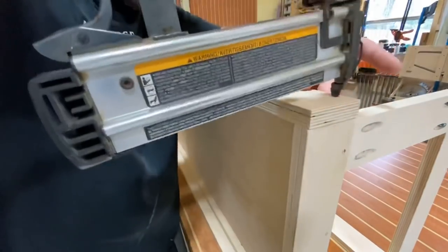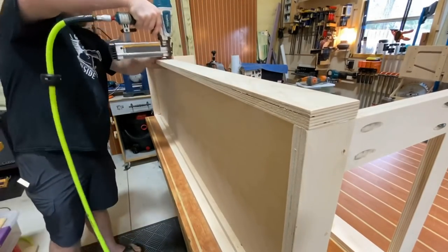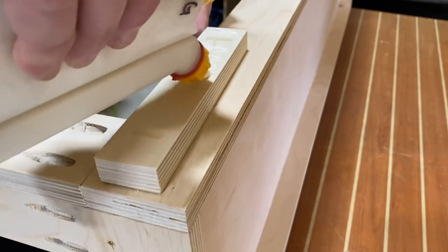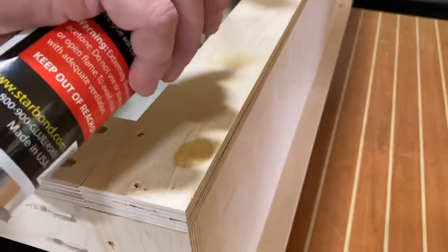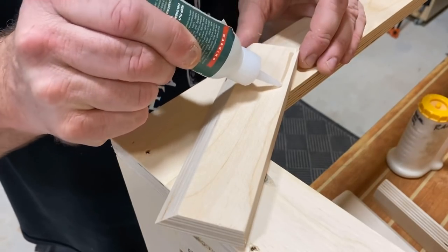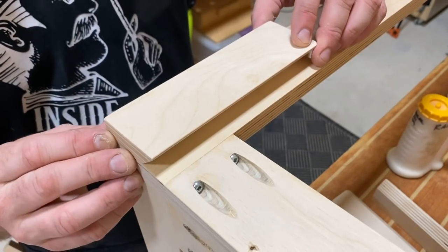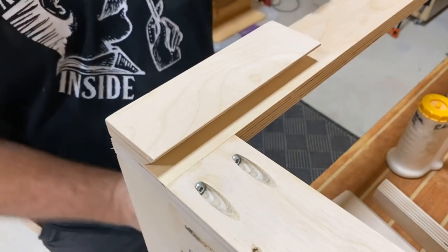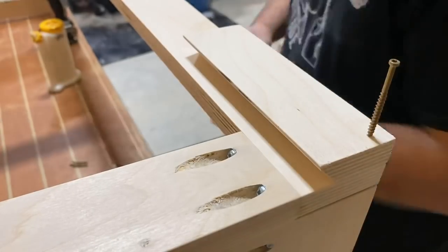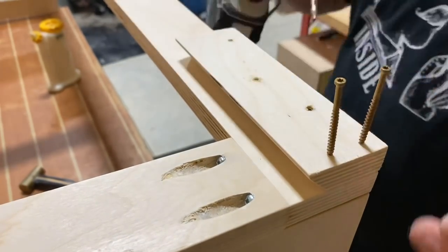One of the final steps is to add the front support piece — you definitely don't want to forget this because the plywood will sag just a little bit under some pretty heavy weight. This piece of three-quarter inch ply at the front was definitely a necessity. Here's some more of the CA glue and regular glue trick: put a little CA glue down, put some activator where you got it. These are the bottom supports for the cleats that are going to go at the top. I use CA glue here without activator at first, near the edge, so I have time to place it where I need it and it doesn't cure right away. Then I place it exactly where I want, spray the activator on the outside — which catches the CA glue that's barely come out — and now that tacks into place really nicely, giving me time to drive some screws in. They really give it some strength.